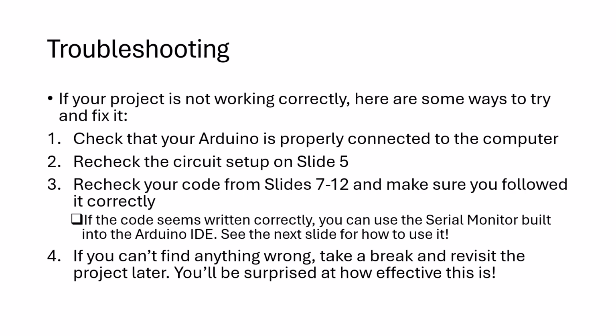If your project doesn't work correctly, here are some ways to troubleshoot the problem. Check that the Arduino is properly connected, check that the circuit is set up properly, and check that the code is correct. Make sure to see if variables are assigned to the right pin slots. Also, remember to try the serial monitor to check certain variables like distance and time. We discussed how to use this in Lesson 2, but you can check the slides or link in the description if you need a refresher. If none of these recommendations work, take a break and return to the project later. It's better to troubleshoot with a clear mind.